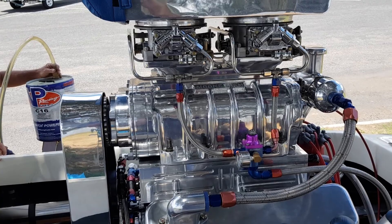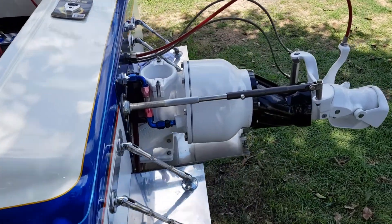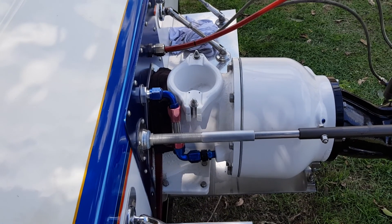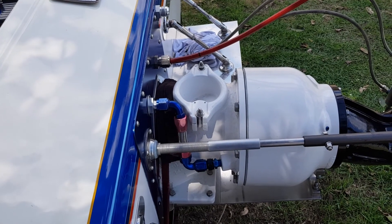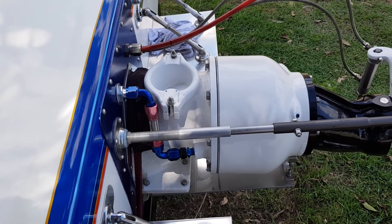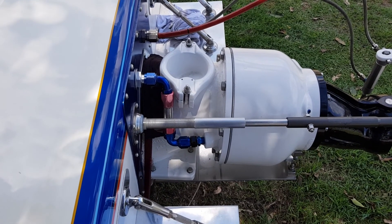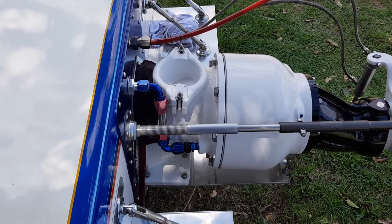We want to make sure we've got enough water and then take it out today for a run to check the idle mixture and make sure it's running good. We also had the jet unit apart — the shaft is slightly different when you run an inducer in front of the impeller. We had an inducer shaft in the other jet unit so we swapped that over. Now we've still got the stainless steel impeller with an inducer, and the shaft was different so we had to machine it — just took maybe 30 thou off one of the ledges to make it fit perfect.